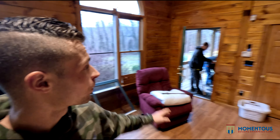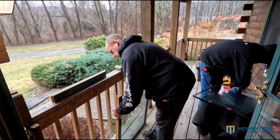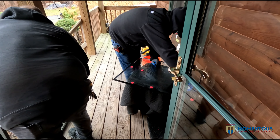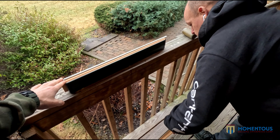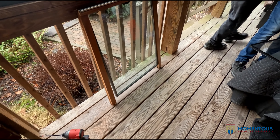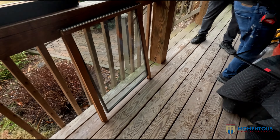As you can see, the sash comes out really easily — he did that in about a minute, got both panels out. We're going to work outside on the porch replacing the actual glass in the sash itself. The first thing we have to do is take off the framing around it, then insert the new glass. You can see the new glass over there. The shellman is taking off the wood framing — the bottom pops right off — and we're going to pop the new one right in.